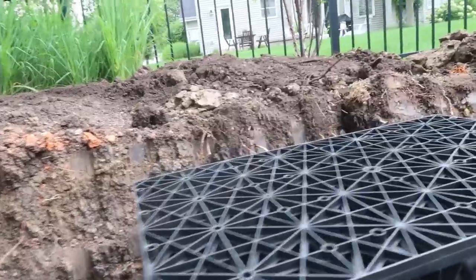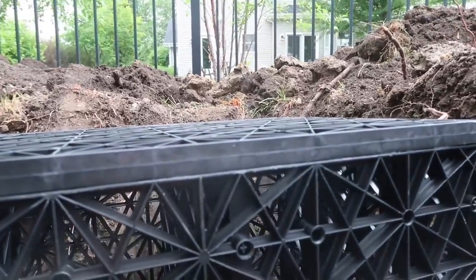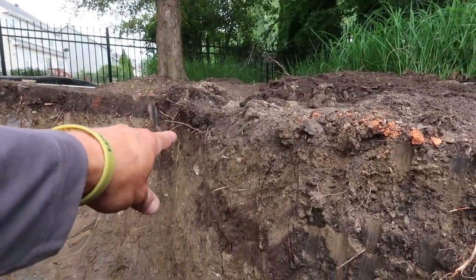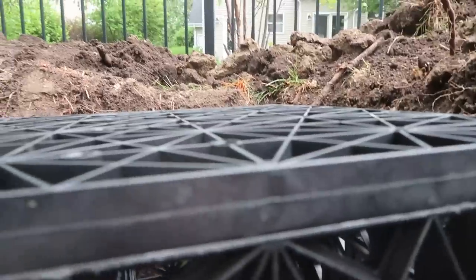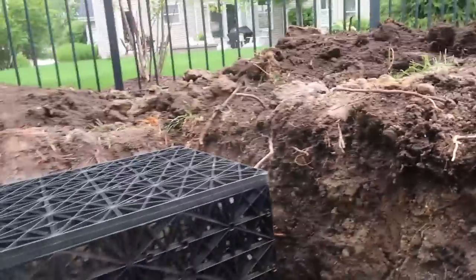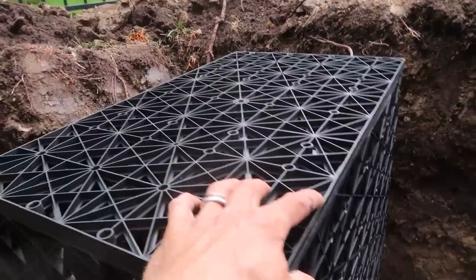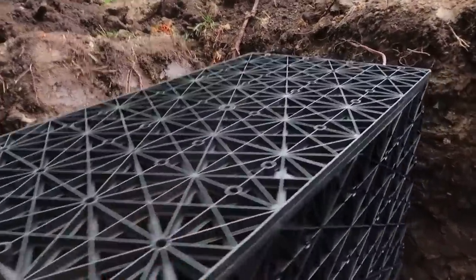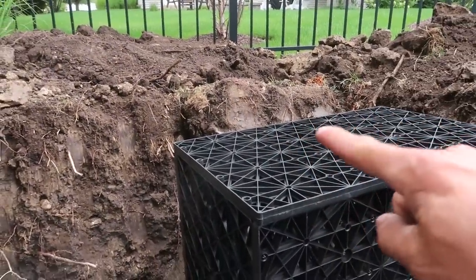But what I wanted to show you is everything sloped away. So you can see this was existing grade right about here. So Dan built that up. You can see the grass right there at that orange paint, and that is right at the top of the AquaBlox. Over here, if I were to move this AquaBlox over, the top of the AquaBlox will be about 4.5 inches below grade there. Here, it's right at it, as you can see. So we ended up building up this back section a little bit. That way we can create a nice edge, make sure that we are totally utilizing all 100 gallons of each triple stack AquaBlox because of the height of this, because our liner needs to go up 4 to 6 inches at least past the height of these AquaBlox.